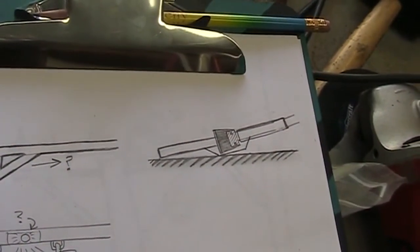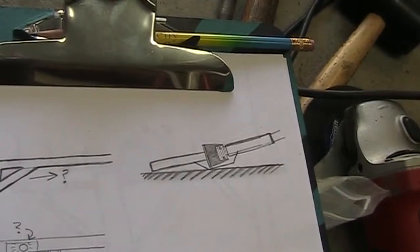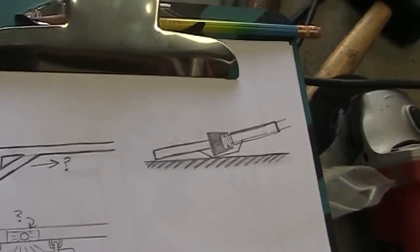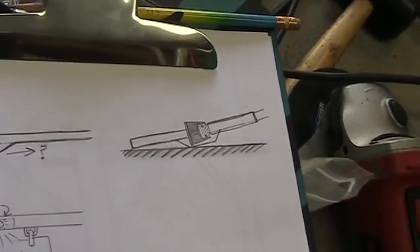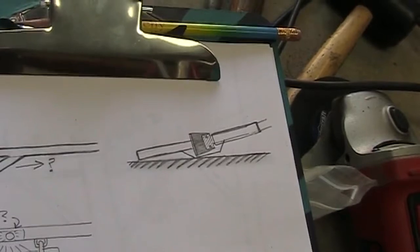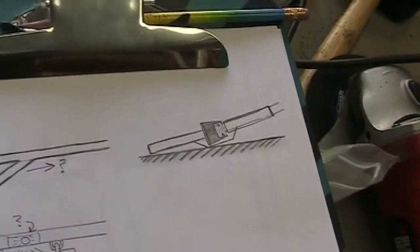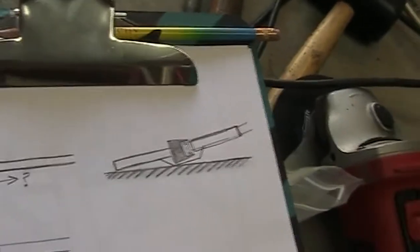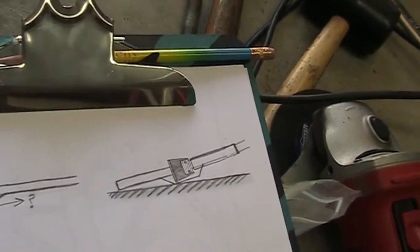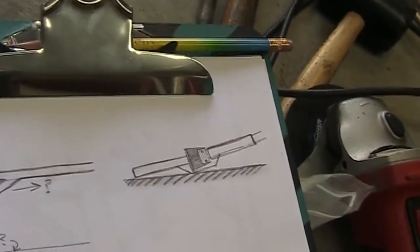The license plate is lit by the underside of the brake light. It's not a big problem that the plate won't be at the absolute rearmost point, but you are required to have red lights at the rearmost point of the trailer at night. So I may have to add reflectors or reflective red and white stripey tape on the rear edge. I've determined the lights don't have to be too far forward — only about six inches — so it's totally acceptable.